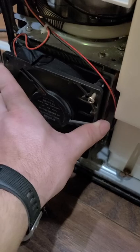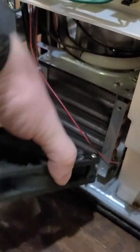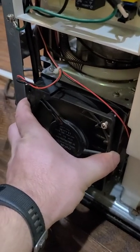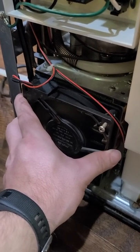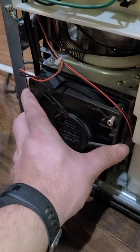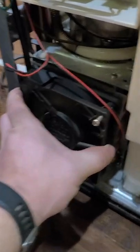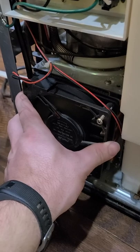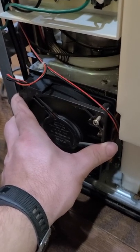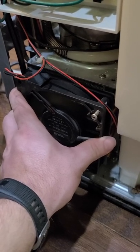What I'm going to do is flip this fan around — that is going to increase the amount of airflow to that condenser multiple times over. And then I'm going to put a filter screen on the back side of that fan so it doesn't push a bunch of dust through there. Right now you can see it's already getting dust in there. Sucking it through versus pushing it in — pushing it in you'll get a little bit more but not a dramatic amount more. So I'm going to turn everything off, flip it around, and we'll see if it still overheats.